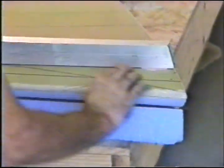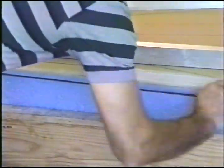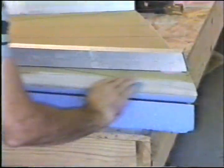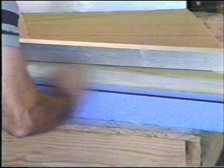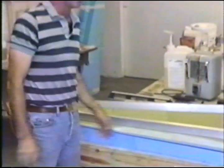Now we're going to sand that. It's been peel plied already, so you needn't use 36 grit to sand it. It'll sand fairly easily. You want to sand the epoxy off the surface so you can see very clearly that you're right up against the glass. This will improve your peel strength by 60%. The whole feel will change when you go through the resin and begin riding on the glass cloth itself. We'll complete that from here to the rest of it. We'll be back with you in a moment.